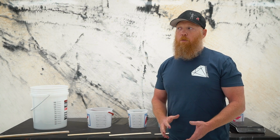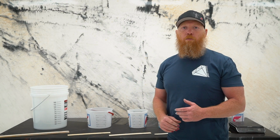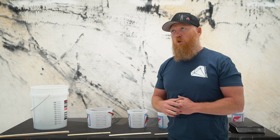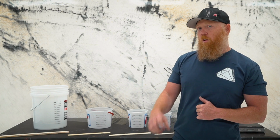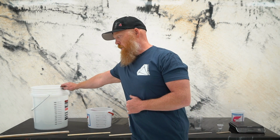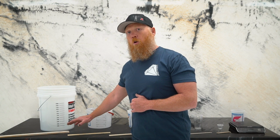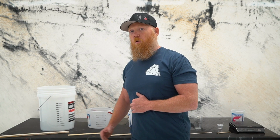So I dealt with this a little bit. I'd seen it, I'd talked to my crew about it, and I hadn't really made a big deal of it. And then one time we were on a floor at a sheriff's department and we poured a pretty large logo, and I believe what happened is they were measured for a coating over the top of a logo. They measured a very small volume in a 5-gallon mixing pail, and this is the exact type of mixing pail they used. Now, since they were measuring the smallest 2-to-1 ratio measurement they could measure in the container to cover the logo with, it turned out to be way far off.